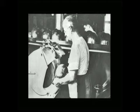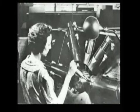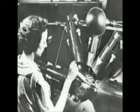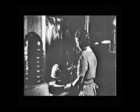Here, the raw edge of the liner was burnished to bring about a heat seal. The newly pressed liner is then positioned in a multi-drill press operation where all the rivet holes and insignia eyelets are drilled into the liner. The liner then moves to the rivet station, where the rivets, insignia eyelets and web suspension are punched into the still unpainted shell. Once the rivets are installed, the helmet is ready for its finish coat of paint.